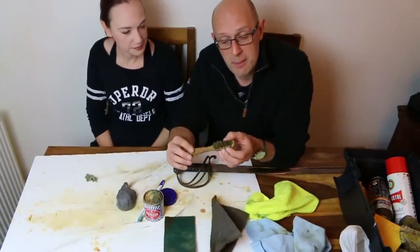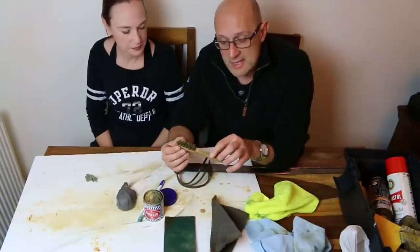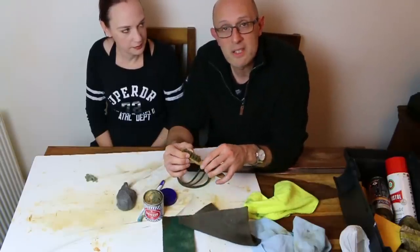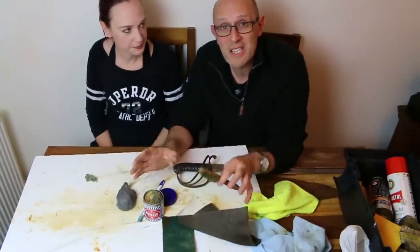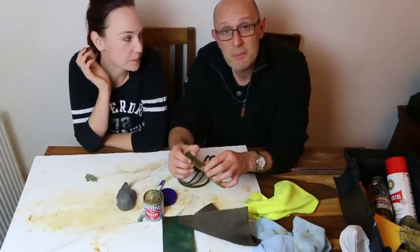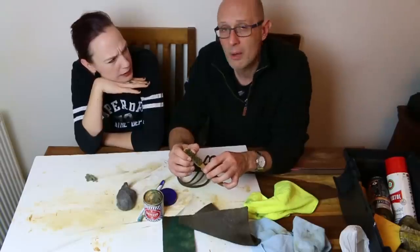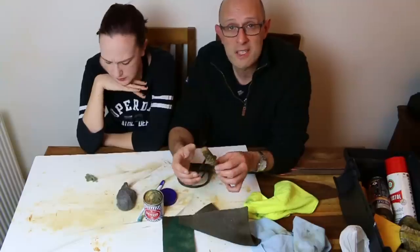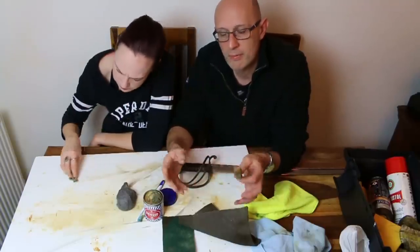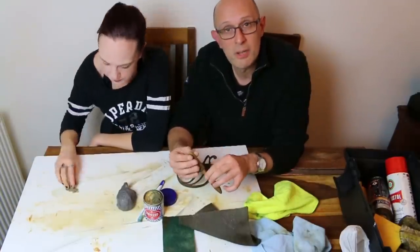And the final thing I would say about these brass brushes, because I've sung the praises of them in this video, is again, just like with the Brillo pads, have a look at some different ones, because don't ever use a steel brush on this. Make sure it's a brass brush. Sometimes you can get steel brushes that have been coated and look like a brass brush. I got one once. I think it's a kind of galvanized rust protection. So make sure it's a soft brass brush.